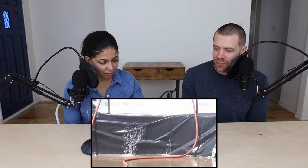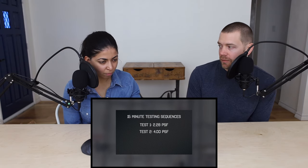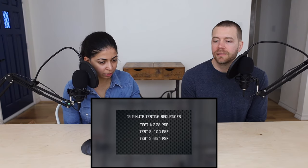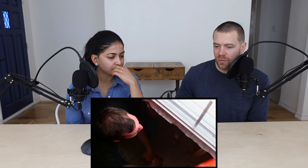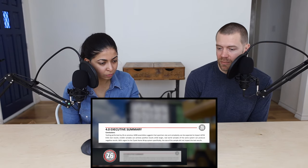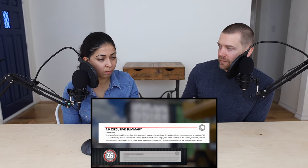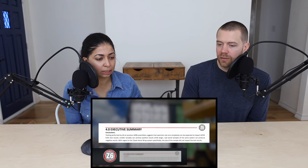This video demonstrates the water-resistive properties of Tyvek, particularly around a window where they've taped over the joints with Tyvek tape. Taping isn't strictly necessary — you could just overlap it about a foot. The most common application method is to wrap your house with at least a 12-inch overlap and then pin or staple it. If you tape all the seams, this acts as an appropriate air barrier too.